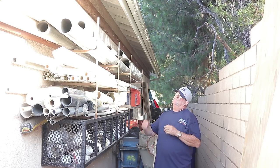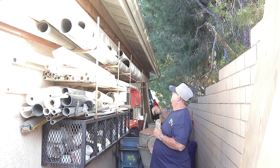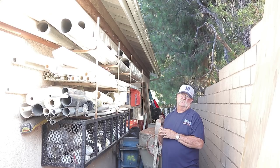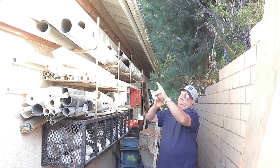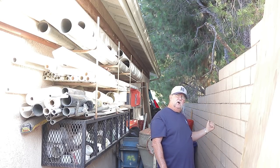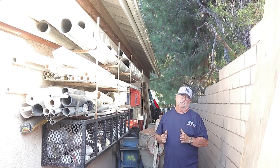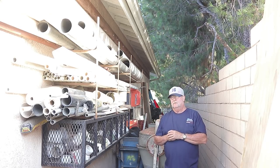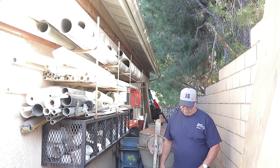What I've done — and I've already started — is anchor a ledger board across the full length of the garage. It's a two-by-six pressure treated. This was a last-minute idea. Then we're going to be using two-by-two square tubing and welding some tabs on that, screwing that into the top, and bringing it over. We'll be bolting posts to this block wall about every eight feet, then bringing some rails — or rafters — across this way, and then I've got some corrugated metal roof sheeting that's going to make it 98 percent weatherproof.